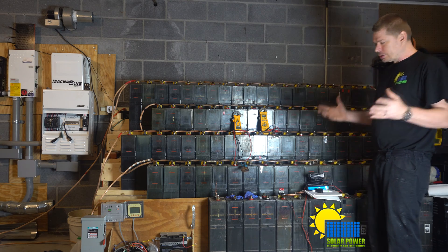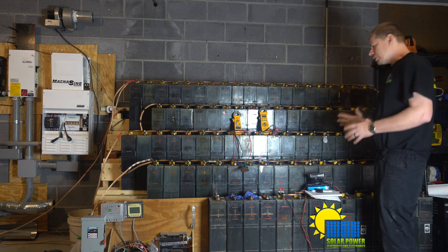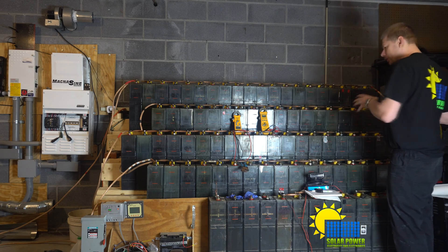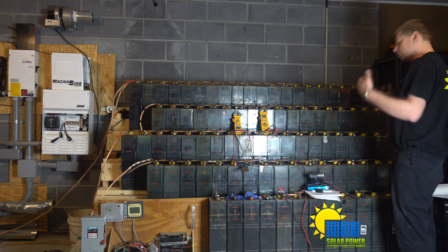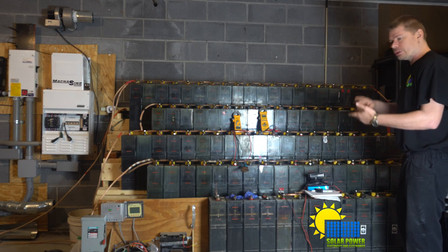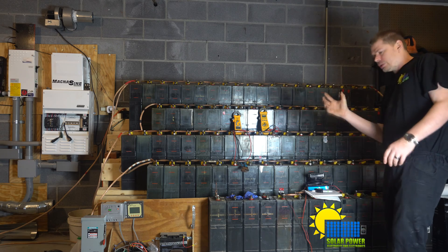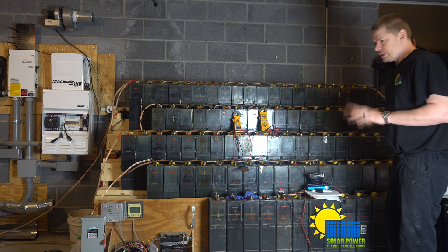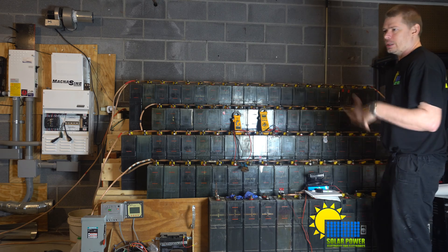These batteries really kick ass, but when they start reversing polarity they seriously diminish the amount of power they can deliver — they actually start charging the battery in reverse. That's reverse polarity: you discharge the battery to zero volts and then it starts going backwards. The positive plates become negative and the negative plates become positive, and that starts attacking the cadmium plates.